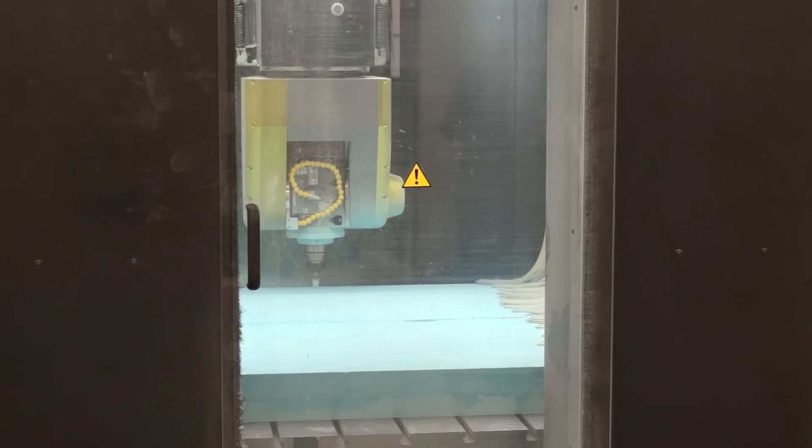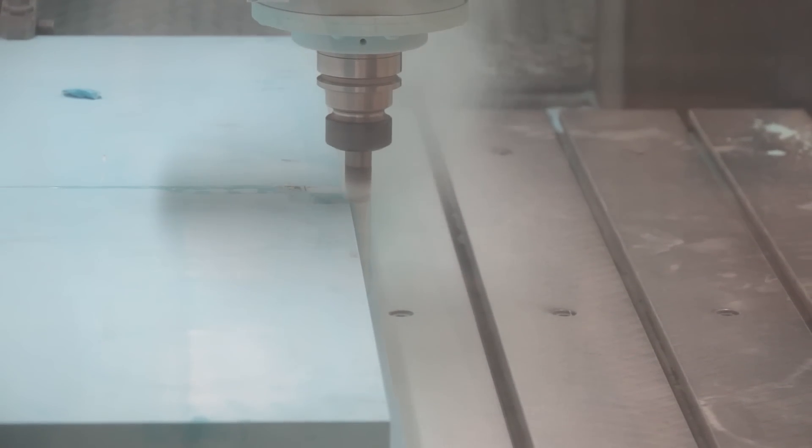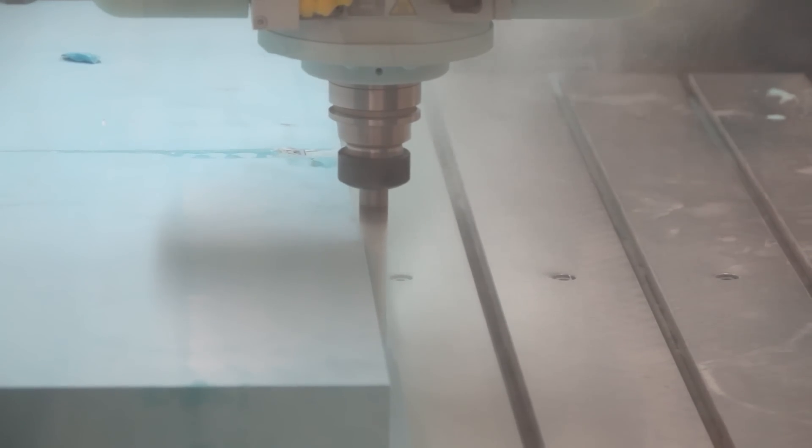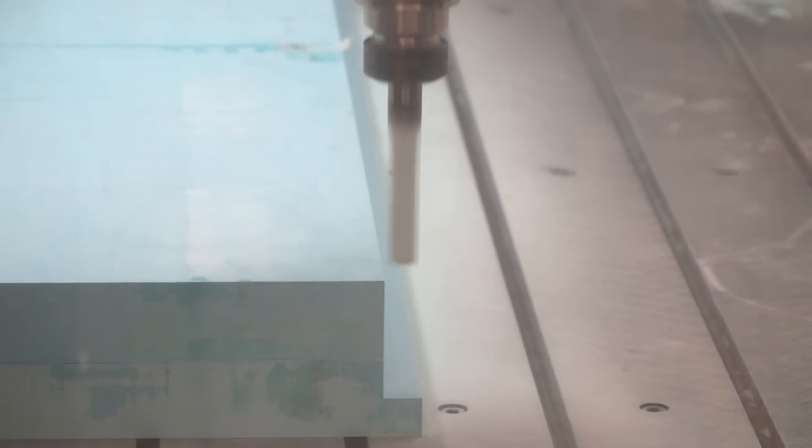What is fast in your eyes? You run at 24,000 RPM because I know that's the spindle speed. Yeah, so we'll be running almost flat out. And particularly when we get to very small diameter ball tools, when we're putting some very fine detail into components, we need a very small diameter ball. In order to get the surface speed out of the tool, we need that sort of spindle capacity.